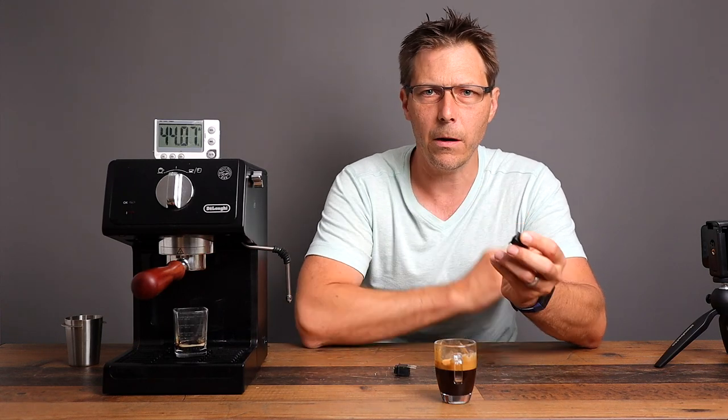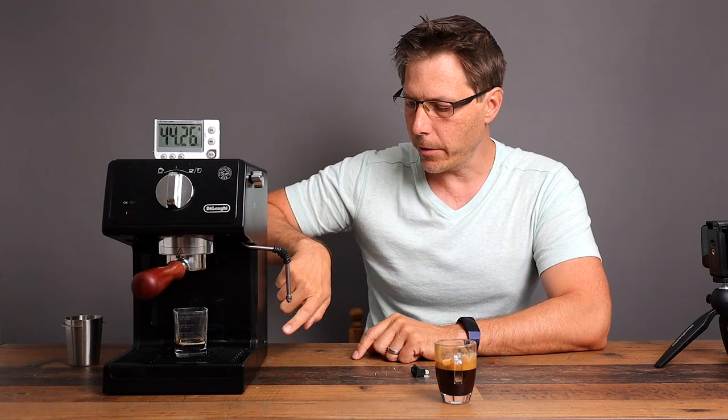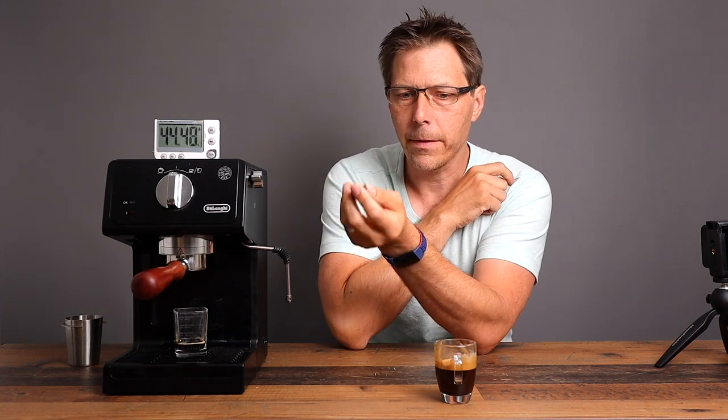Now what we can do with this rocker switch is, since there's always going to be voltage on it in the on position, it bypasses the timer after that 10 minutes. After that first 10-minute timer has elapsed, if you want to turn off the machine you can — all you need is a negative edge at the power switch, going from a one down to a zero, and that gives the signal to turn off. But if you're within that first 10-minute timer period, you need to give it a full impulse — go up and down — which is why you have to turn it off, then on, then off. That is the one thing to keep in mind. But let's go ahead and install this on my other machine.